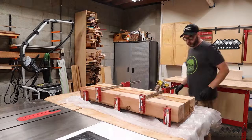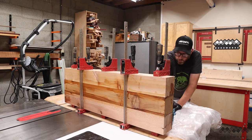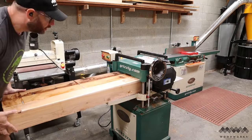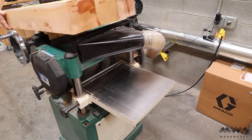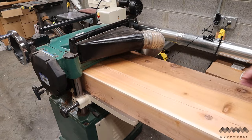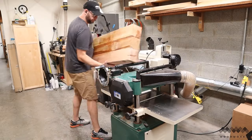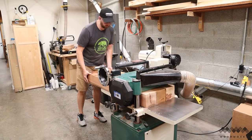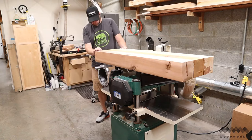Clamping pressure is applied evenly across the length of the glue-up, and I wipe down any excess epoxy. Now comes the fun part — I've got to wrangle this thing through my planer to clean up the surfaces and get everything flat again. Since I already flattened everything before, this doesn't take very many passes at all. This is also why I wiped down the glue joint earlier — less interference from dried epoxy means the piece lies flatter going through the planer.